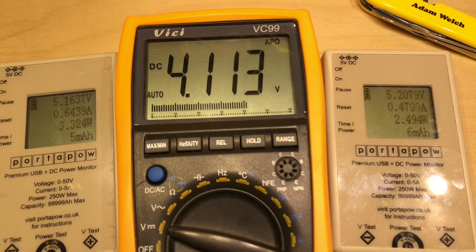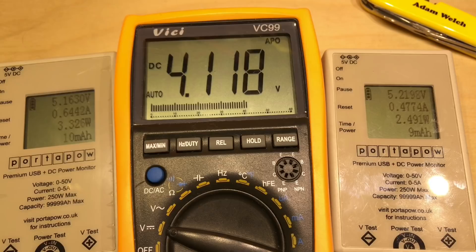It's realized that the battery voltage is dropping and the TP4056 has started charging the 18650 in this UPS module. We've got 643 milliamps coming in and 477 milliamps going out into that electronic load, so that means the battery voltage is slowly creeping up — we are replacing that energy we've just depleted.